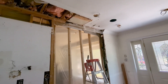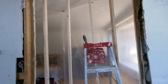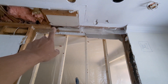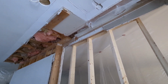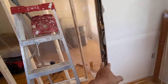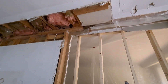Hello everyone, welcome back to my YouTube channel. Right now I'm doing this opening here, which is about almost 5 feet. I'm going to put up a load-bearing beam using two 2x8s and one jack post — just one here — and that should be fine just to support those ones.